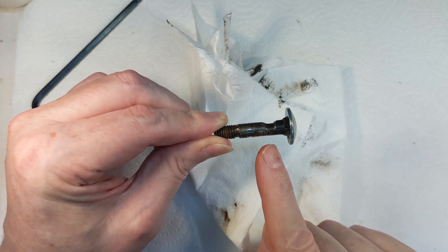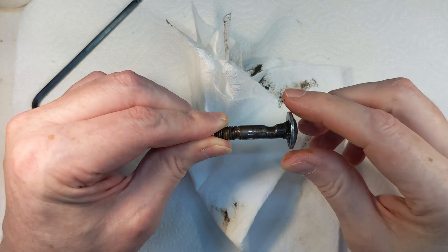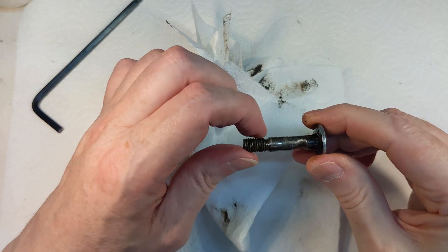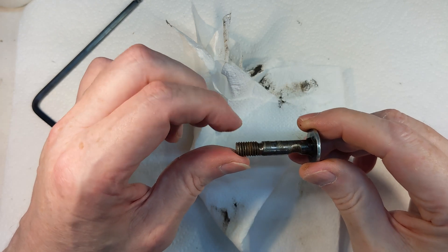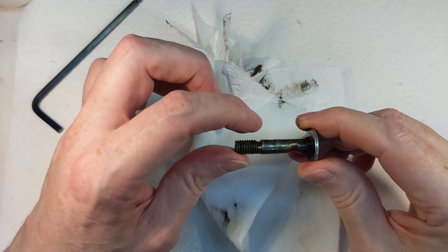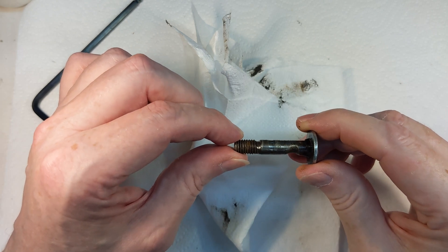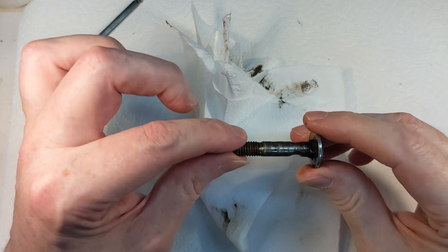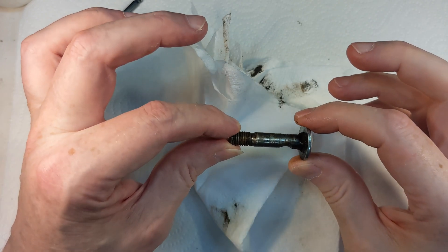In the two days it took the bearings to arrive, that's how much the chain had worn through the bolt. And on the other side you can see another groove starting to form — that's from the bracket where it's been moving and wearing through. It's not only a maintenance thing, it's also a safety thing because eventually that bolt would have snapped.